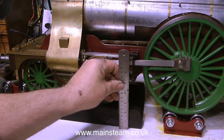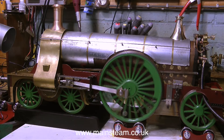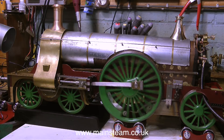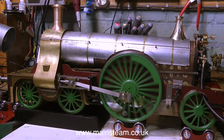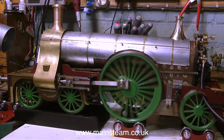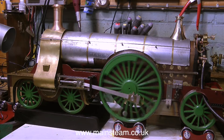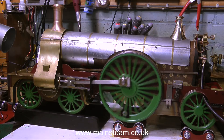The piece of wood supports the two front wheels and now all the engine's wheels are at the same height — well, that is the theory. But of course they aren't, because the other two pairs of wheels don't ride on top of the bearings. The driving and trailing wheels are just below two inches, because both of these sets of wheels slightly fall into the gap between the two bearings, which is fractionally less than two inches from the bench.